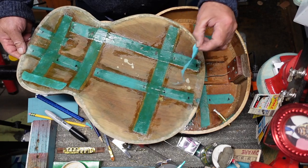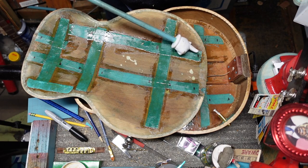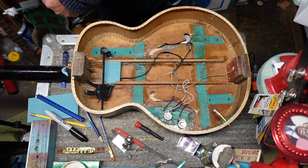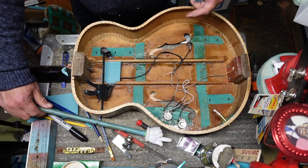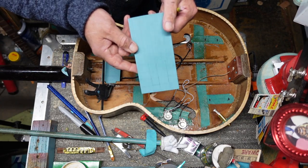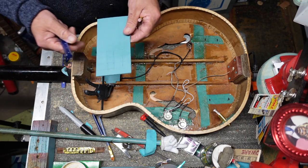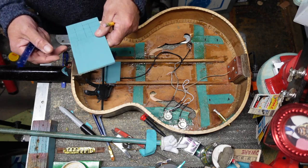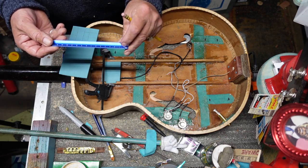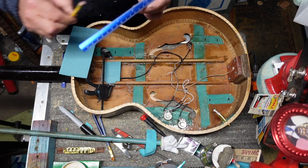I want to show you here. I've got some little marks here. Those are where I want to put the cleat. So I've got a bunch of little cleats to cut, and I'm not going to bore you with all that. But I do want to show you a little trick. Now, I've put a grid out. You can probably see it here. But have you ever wanted to find the middle of something, but your ruler wasn't long enough or something? Hey, check this out. As long as I start something I can see has markings on it. This is an architect ruler, an engineer's ruler.